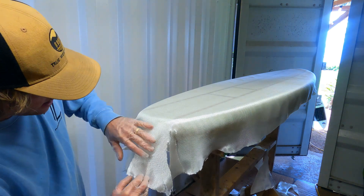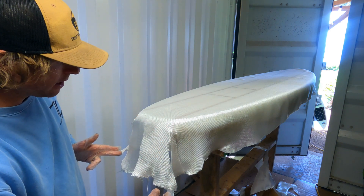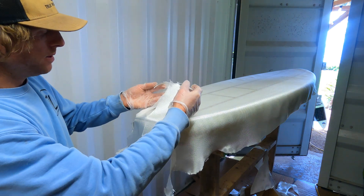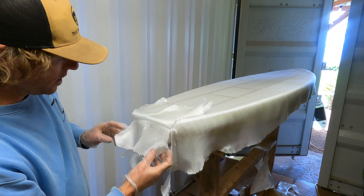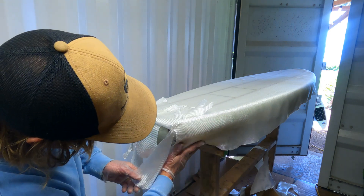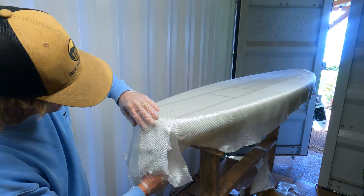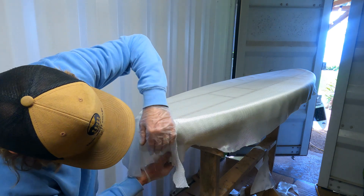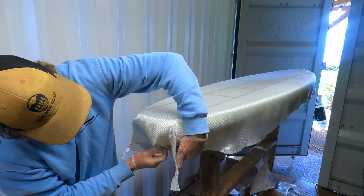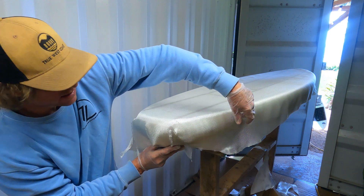So if I fold it up, this is the top lamination, then this is the three-quarter length patch, and then this is the small patch. What we'll have is the side piece wrapping under, then all of these laying down. This will wrap under onto the top of the side piece, and this can then lap over the top of that. Then this triangle pulls it all down into the corner. It will obviously look a bit neater once the resin's on.